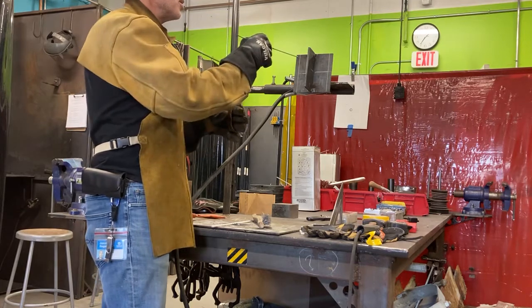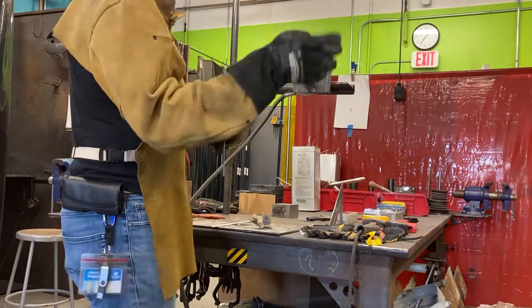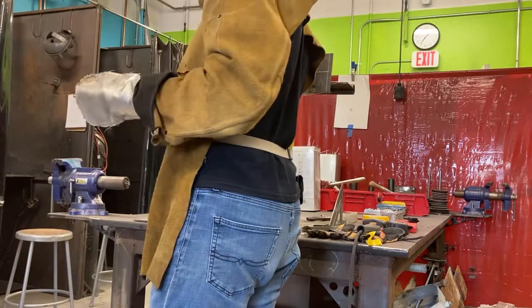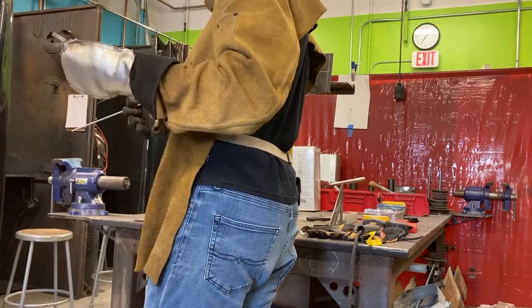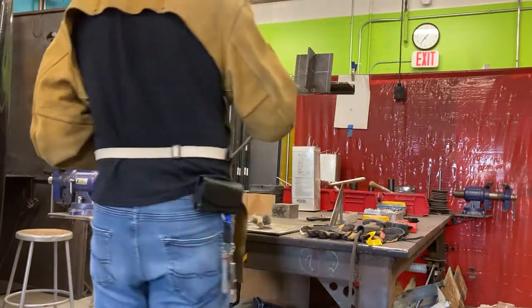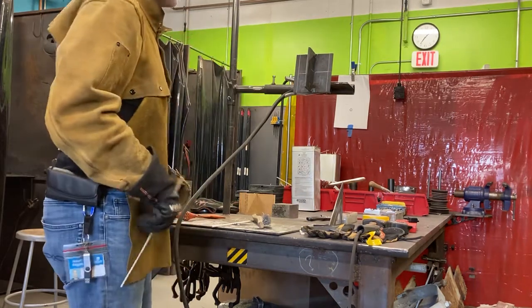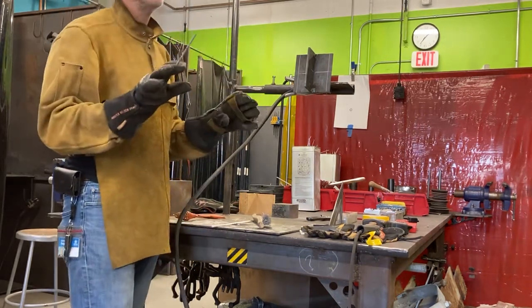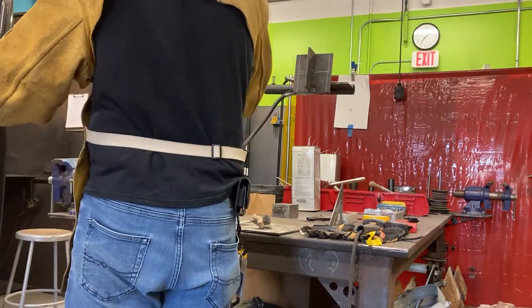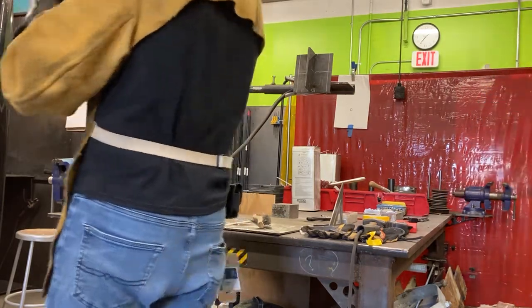So that's a 6-inch run, 3 here and 3 here. A 6-inch weld bead. Well, there's a problem here. If you remember, the sheet I gave you says you may not start or stop on the corner. That's a universal rule for structural welding. We want to get in the habit of this. We're going to be doing this with TIG welding as well. So I can't stop in the corner and then start up again. You may not do that. The reason is you're going to be forming almost like a joint, a crack, that will fail under stress. You need to weld through a corner.